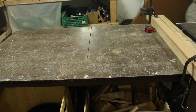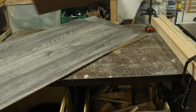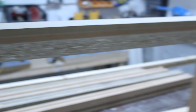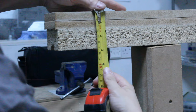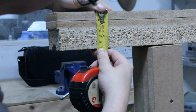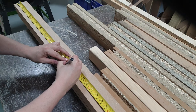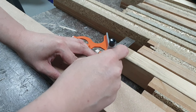As well as long pieces of wood I also had a collection of sheet material which I planned on using for the top of the workbench. My plan was fairly simple — all I wanted to do was create a basic frame which would include the legs and a cross beam to support the weight of the worktop. I had previously worked out the height I wanted, so I started measuring the width and length of all the wood pieces to cut them to size.